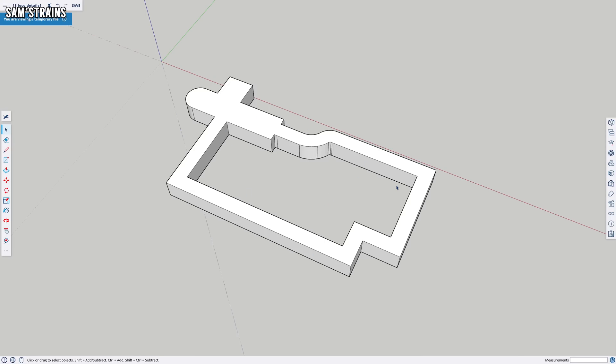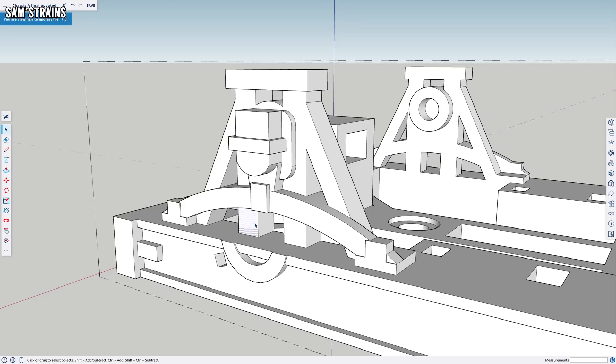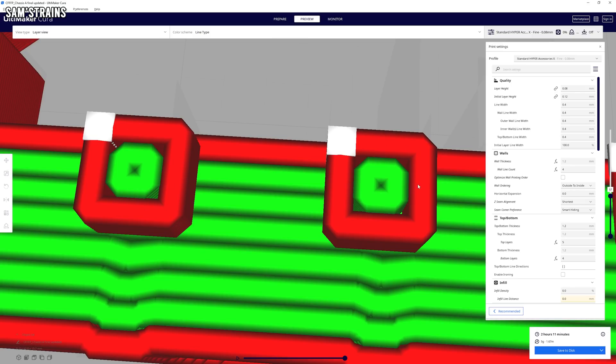This is particularly important for small detail parts. Here's an example: this is some of the pipework from my Great Eastern 552 loco, and I've designed it so that this part can be printed with one pass of the nozzle without too much complexity. Here's another example — this is the axle box of one of my 3D printed wagons, and these vertical supports are absolutely tiny. By making them 1.6 millimetres wide — 1.6 being a multiple of 0.4 — the supports are exactly four lines of filament thick, which I know from experimentation will create a part that is strong enough. So again, keep that nozzle width in mind.